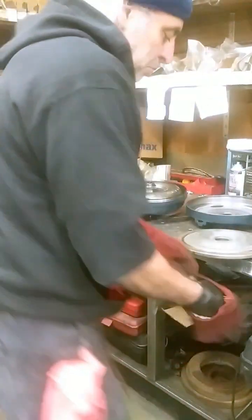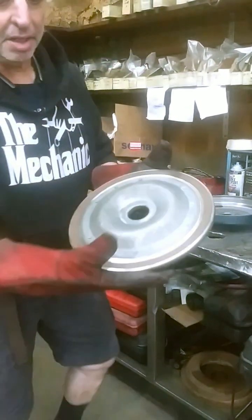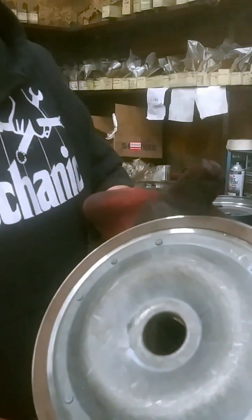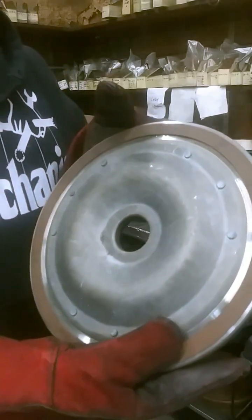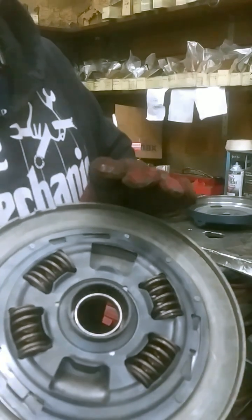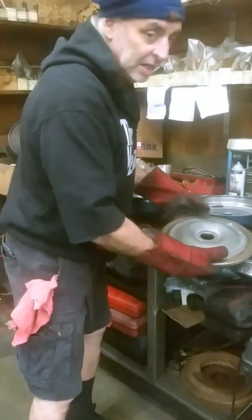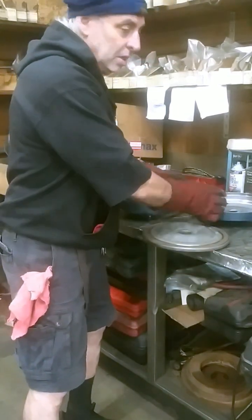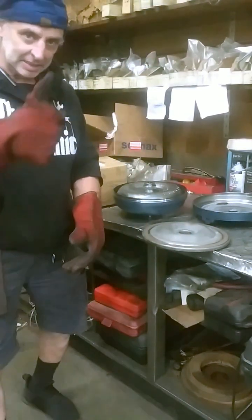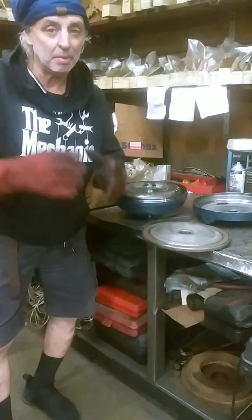This is what the final product looks like. It comes out of the bonding oven — you can see a nice new clutch lining is bonded on there, nice ridges cut into the piston. Hopefully this clutch will stick. Make sure the springs and all are good. We just let it cool down naturally — I don't blow any air on it, just let it sit there and cool. And I'll install it into the converter, weld it up, and send it on its way. Thanks for watching — like, subscribe, have a blessed day.